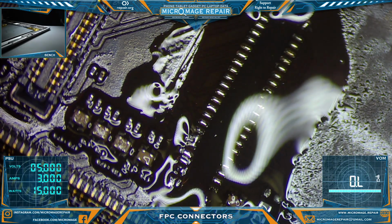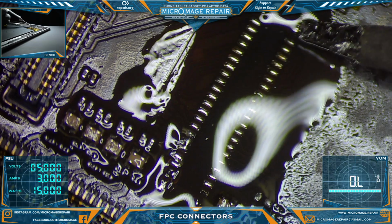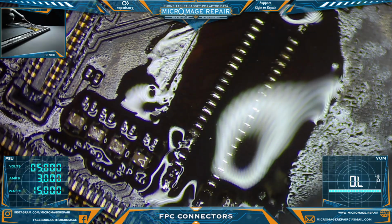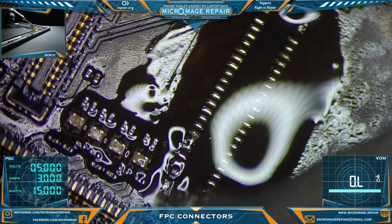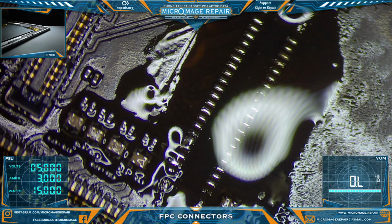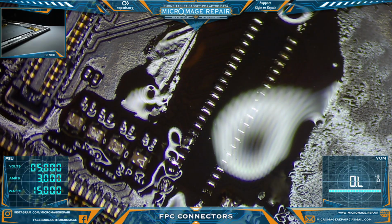Alright, let's clean it off and see if we can flatten out those anchors a bit. You definitely want to flatten the anchors, otherwise the connector will bridge. It will basically act like a suspension bridge, with those as its primary spots. And then you can have a real challenge if you're having to sit there and try to solder the connector pin by pin.